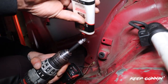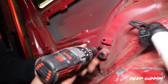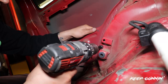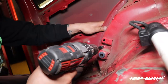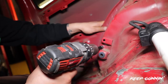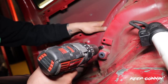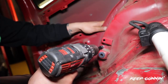We'll lube up the bit — just a little touch — because we're trying to save as much as we can on using this. So nice and easy. You don't really push too hard. Real easy. See, it's walking — I wasn't in the center. Right there, that's my center. Nice and easy. Just let the bit do the work, and it will tell you when it's ready to come out. I'm not even giving it way too much force. I'm just letting the blade do its job and cut. And this is going to look phenomenal when we're done.